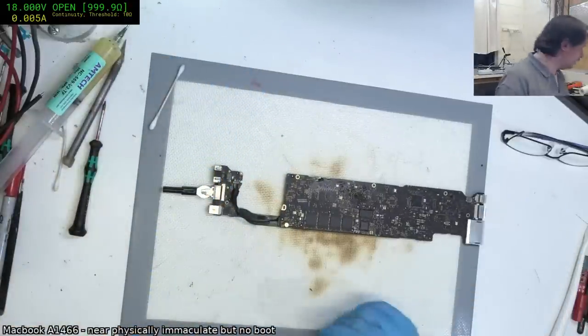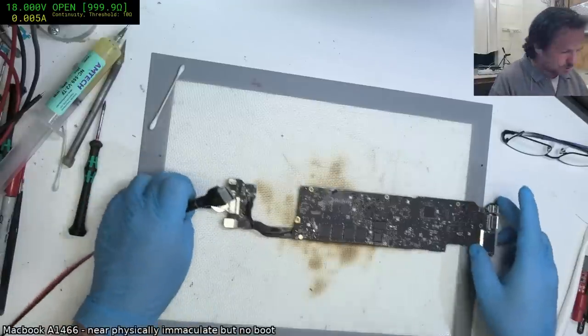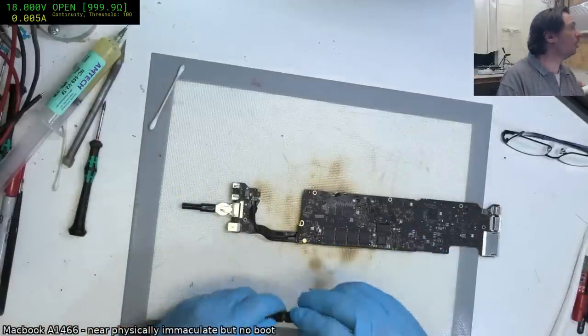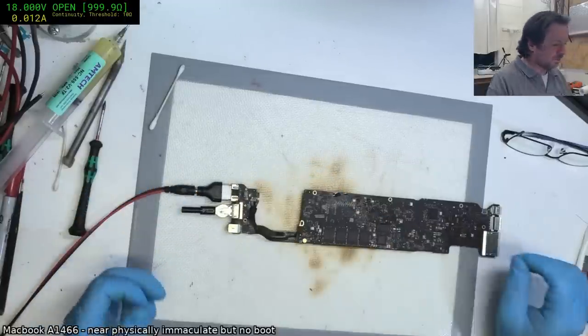Oh dear God, no, never use a short killer on boards. The trouble with short killers is that more often than not, you'll probably end up blowing a trace rather than the part, and that trace may actually be important.